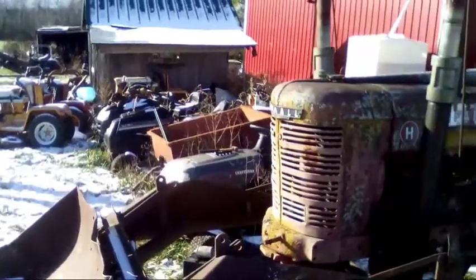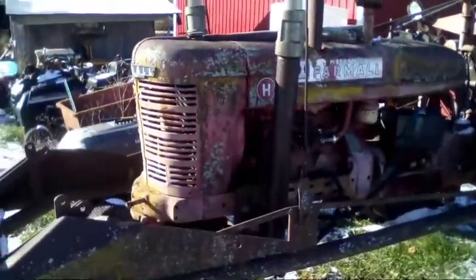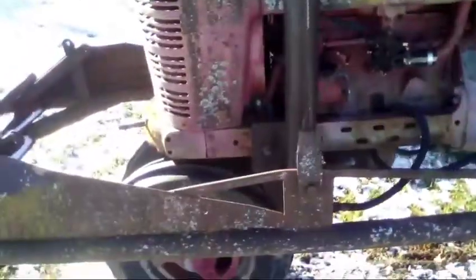There's some little... Oh, it's not little. It's the whole hydraulic cylinder setup is not what the H5 Horn loader would have had on it. You can see these mounts here would have gone up and back. And then the cylinders would have faced backwards, and they wouldn't have had a cable. They would have mounted to a framing that went from these points here, up to those mounts on the front there. And they pushed up on that. And even stranger, they were actually double cylinders. There was a cylinder inside of the other. And that allowed for even more height.